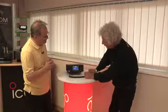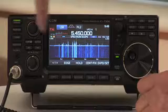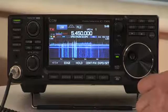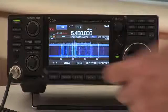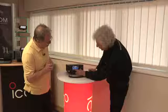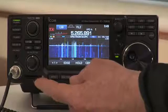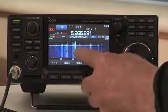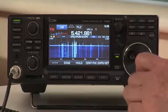For most people who've used an SDR in its traditional computer-plugged-in form, they're used to what the waterfall looks like, and on this display it's really usable because you can focus in more on it. If you tap on the screen it zooms in on that part of the screen, and you can also change frequency — so if there's an interesting signal that you see on the waterfall you can zoom in and actually change the frequency of the radio.